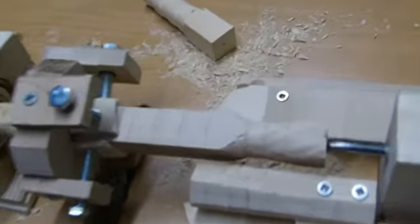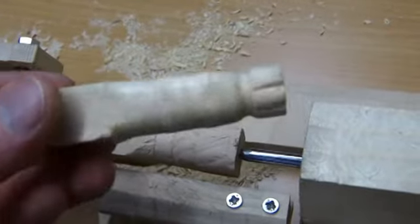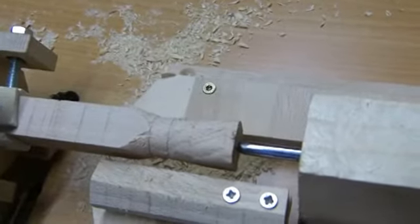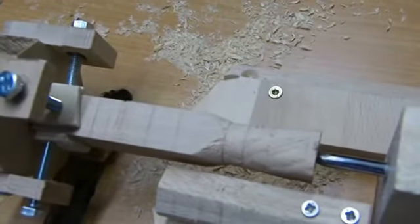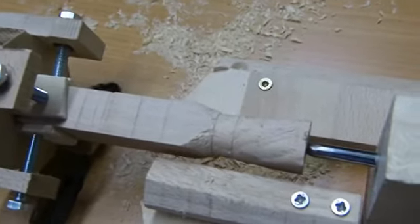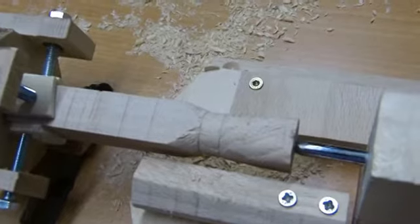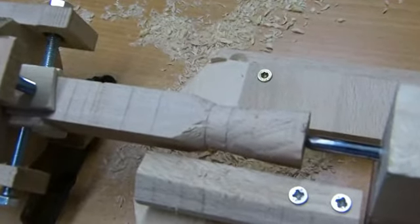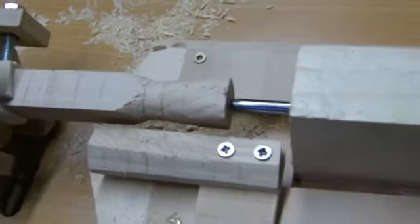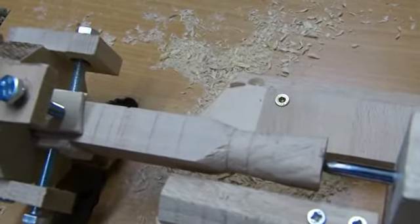Here's another test piece I did before — this is softer wood, it's spruce. I wanted to try a harder kind of wood; this is beech. My tools are also not very sharp, and this might be a bit too hard for this simple lathe. It takes quite a bit of strength to hold the tool and cut that wood. Yeah, this is pushing it to the limit, but I'm thinking maybe I can make some knobs for drawers and things like that on this, just for fun. And it was fun building this.